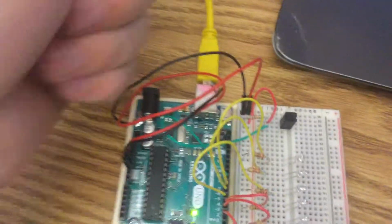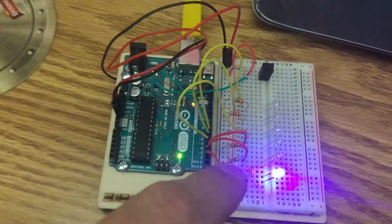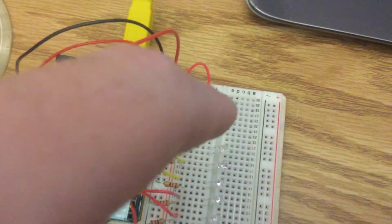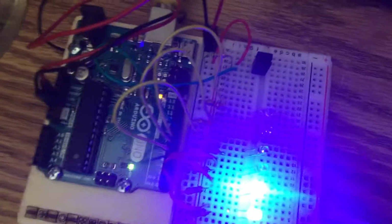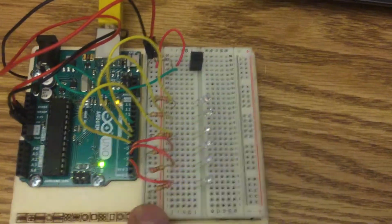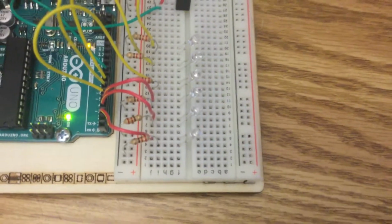So originally we got power, usual, from the yellow cord, your red and your black, into the board over here. Now all this is doing is basically your power's going through the switch, and what that is into the green wire. The green wire is the input shown on pin, I think that's 8. Yeah, pin 8. What that does is the program as it runs through, it checks the switch state, and basically whenever inputs a signal, it resets the timer.